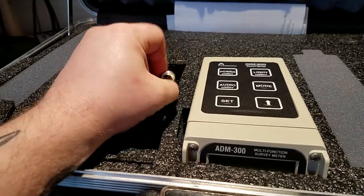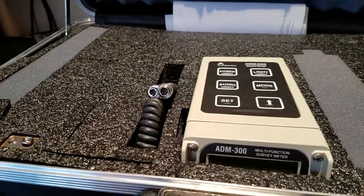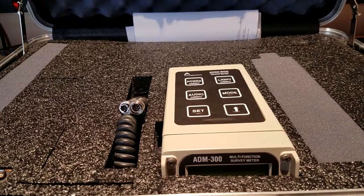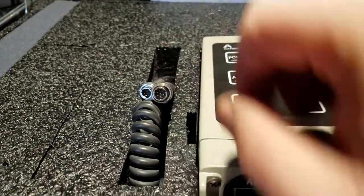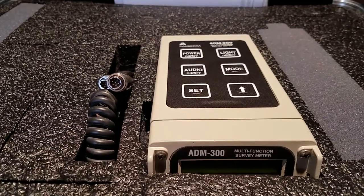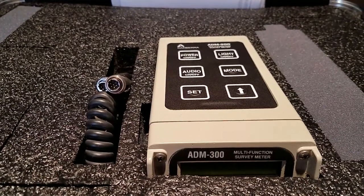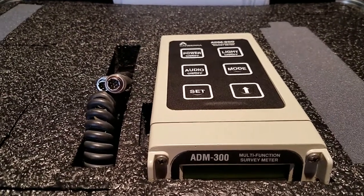It's also got a cable for what are called smart probes — those are the additional probes that would be included. Those probes are very interesting because unlike most Geiger counter probes where you can snap on a BNC connector and the probe just works if you have your high voltage adjusted correctly, that's not the case here. These actually provide digital I/O and voltage to the probes themselves, which contain their own calibration information and their own high voltage power supply. So you can't just get normal probes to work with this thing — I'm pretty sure you could reverse engineer something, but as-is you can't.